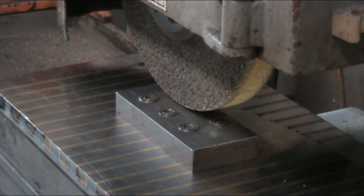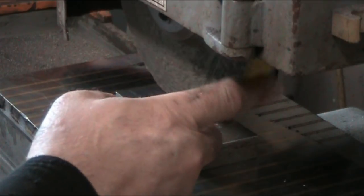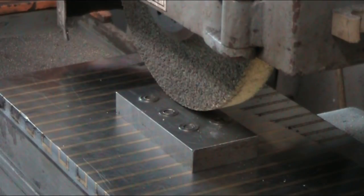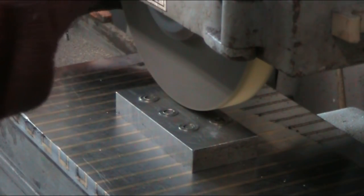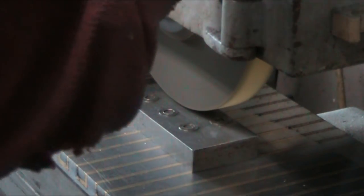Okay, now we are all mounted up. This grinder has a bearing problem, and so we'll end up with a scalloped finish on the workpiece, which isn't really all that attractive. Every time you turn this machine off and then restart it, it gives you a scallop finish. So we have to joint the head, the grinding surface on it, which we'd do anyway. And so we're going to do that and then start lowering this onto the work. Okay, that's all equalized now.